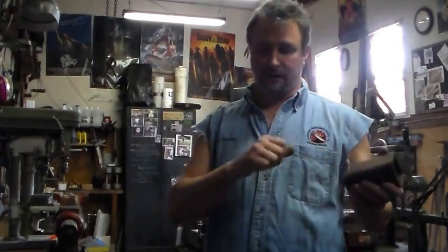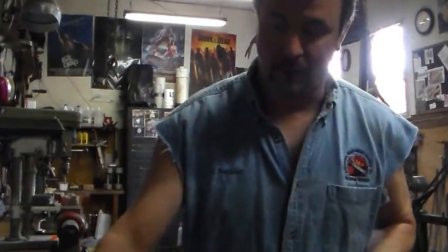Until it's etched for the most part, you're not going to be able to tell which is the can and which is the good steel. So you're constantly grinding it, etching it a little bit to see if you can see the pattern — not there yet — grind it a little more. It gets very monotonous. Those of you who know me and have been in my shop know I like to keep things as simple and as easy as possible. There is a lot of hard work in making knives; you don't need to make it any harder than we already have it.